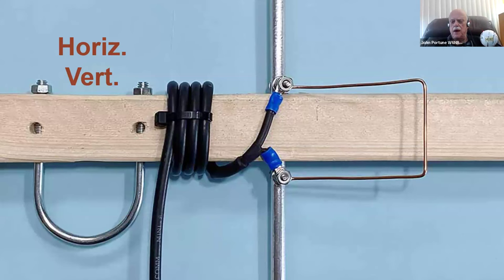It's a half inch gap or a 1 inch gap. The length of the gap doesn't matter. I think it's a 1 inch gap there in the middle of the boom. I took the foil off for a 1 inch gap, and then I drilled some holes through the middle of the rod there, using a little dowel drilling jig so I could get the hole straight through the boom. And then there are 6-32 screws, 3/4 inch, with some nuts and washers to go through, and that's what the little loop in the end of the hairpin is for, to go over the screws. It's also the feed point where the little balun hooks up.